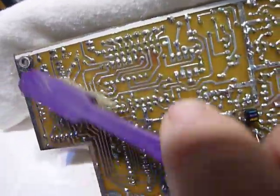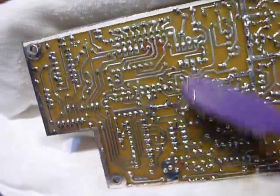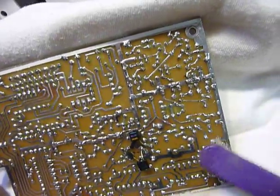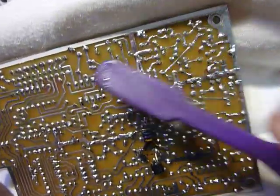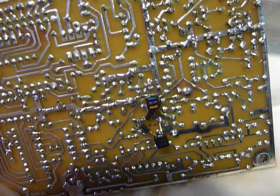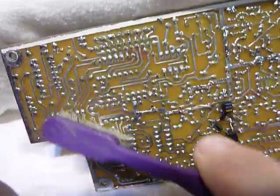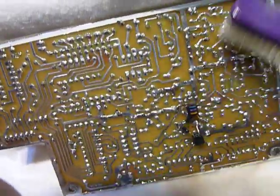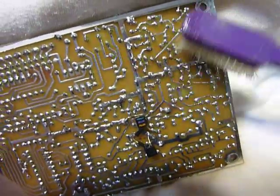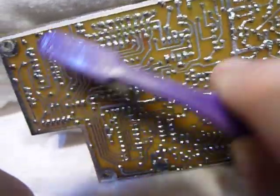So this is segment two — cleaning the circuit board. I've got an old drop cord light and I'll just suspend this over the light, turn it on, and let it go for a couple of hours. Or I could just set this thing on one of the heat registers in the house — we've got a forced air heating system. I'll just set it on one of those. It's cold weather outside, so when the furnace comes on it'll dry this out real good. I'll just leave it on there for the night without heating it too much.